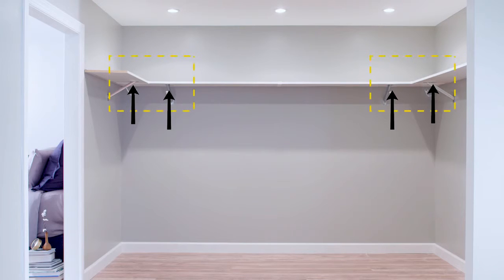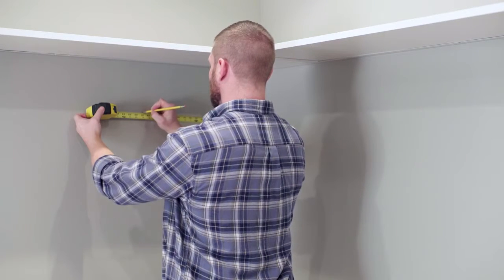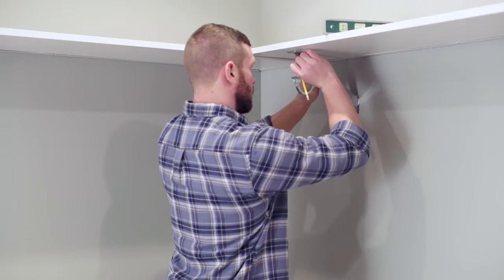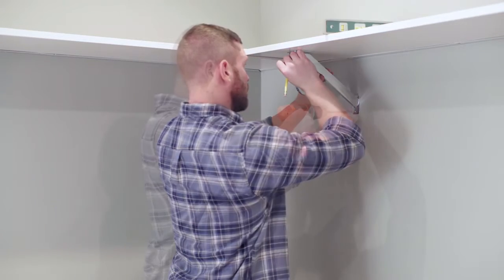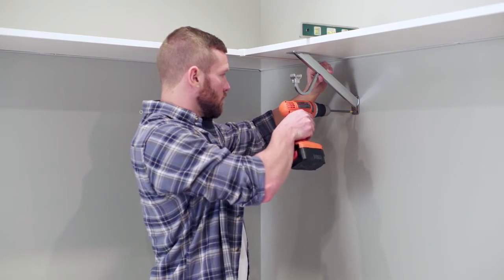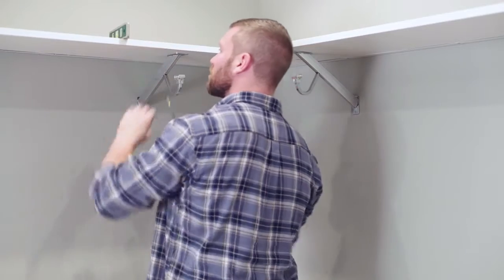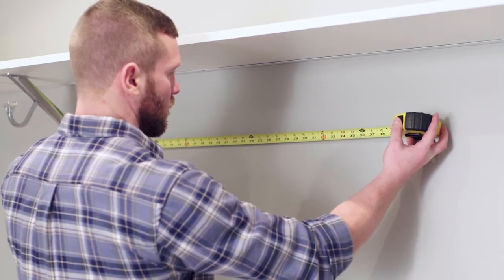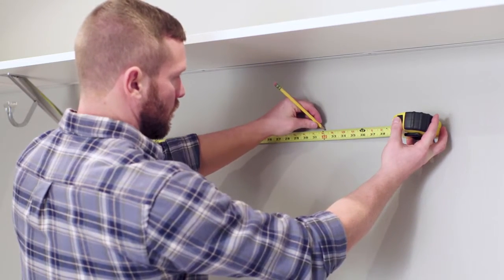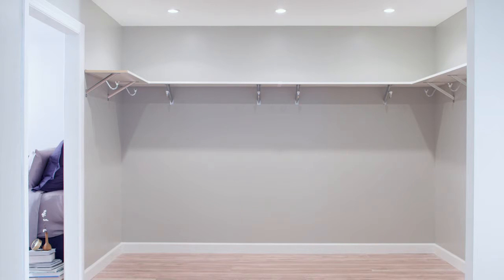Let's move on to the corners. Mark the position of each bracket 21 inches from each corner wall, followed by inserting the anchors to the wall. Then fasten the brackets to the anchor and secure the brackets to the shelf with number 6 by 5 eighths inch wood screws. Repeat these steps for the next corner. Install additional brackets as needed, evenly spacing them no more than 32 inches apart.